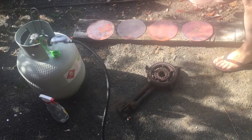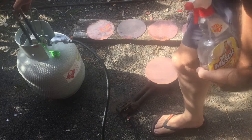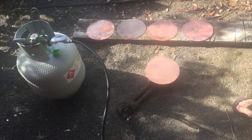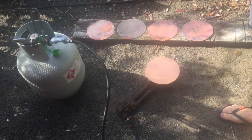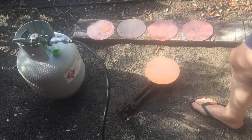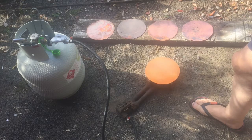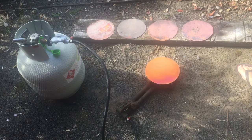I've got one remaining disc that I want to spin — it's pretty thick copper, this one. What happens when it gets hot is the atoms get randomized and lose their crystalline structure, and that makes it much weaker and softer — that's what I call annealing, making it soft. Normally it's brought to cherry red and dumped in cold water, the way I was taught. But this isn't quite getting to cherry red; you'll notice some pretty interesting colors, and eventually it turns black, then I'll spray it with water to cool it down.